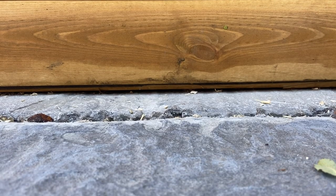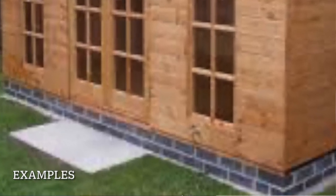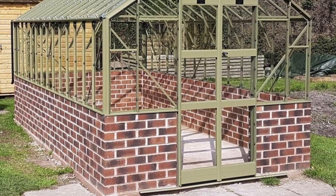The idea of having this concrete base is that we can put the shed down on here and seal it into the floor — making it as hard as possible for vermin to get inside. What I'll be doing is putting the wooden shed down with runners across the concrete, then sealing it around the outside. I'm thinking of running a couple of courses of bricks around the outside so they can't go underneath and come up through the floor. Concrete also means you can jet wash around the sides of the sheds easily, leaving no seed or mess that might attract vermin — unlike a gravel base where seed can drop in and be easily picked up.